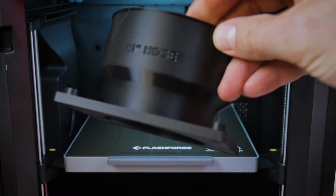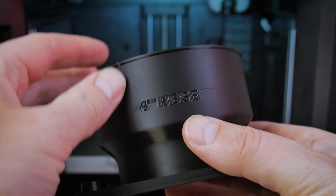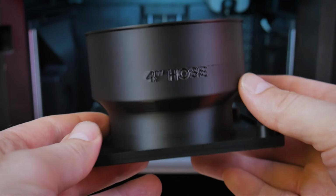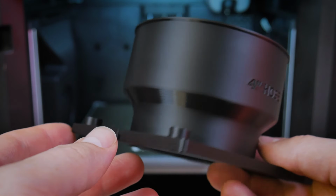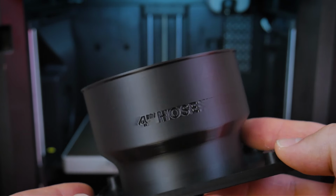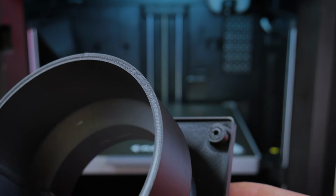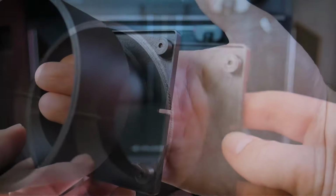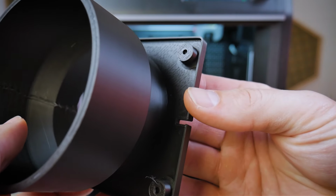So I'll cut right to the inspection of the 3D printed part using Orca Slicer. And as I expected, it looks more or less the same as the version printed in Orca-Flashforge. We've got pretty similar ghosting and ringing around that text, which I'm not crazy about, and a slightly rough, maybe even under-extruded top solid layer on this portion of the print here. Now that could be a pretty easy fix in the slicer.